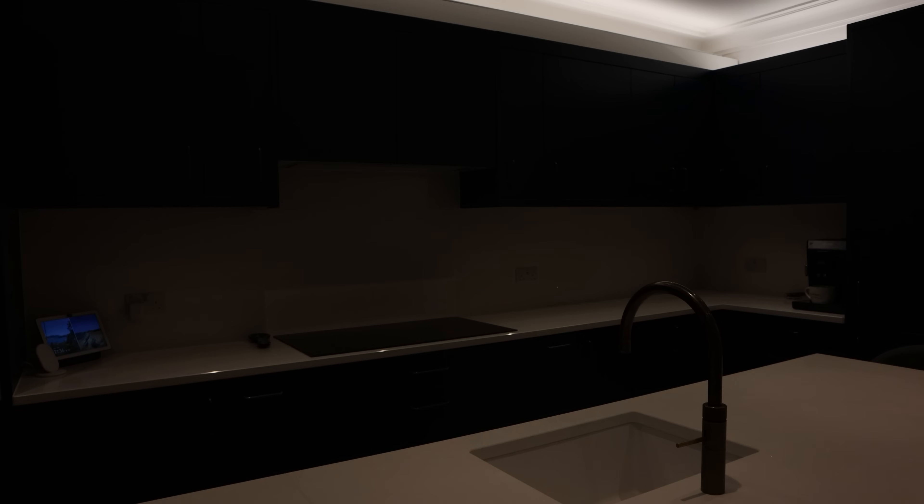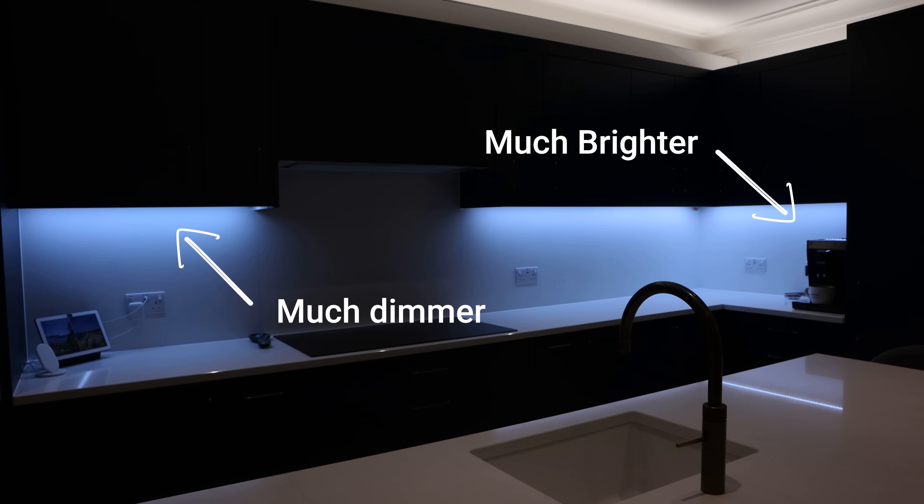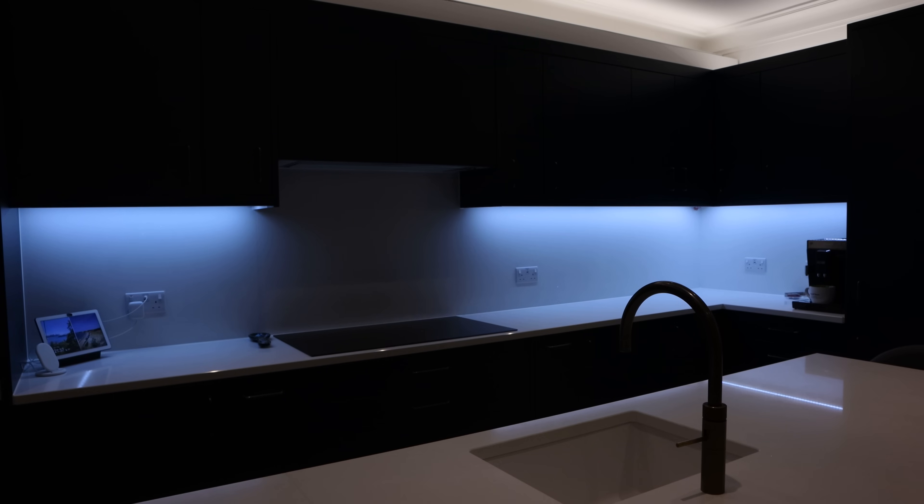The cable from the controller drops through a void behind the kitchen cabinet in the corner. One of the annoying things about these digital LED strips is that you need to connect the data cable to the start of the light strip, which was way over in the opposite corner. I ended up using a hot glue gun to stick some thin low voltage cabling into the aluminium channel and connected it to the start of the strip with more WAGO connectors. With them all mounted into place, I turned them on and noticed that the lights at the start of the run seemed to be much brighter than those at the end — I was running into that pesky problem called voltage drop.